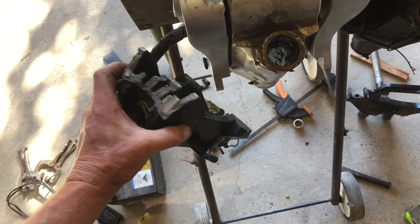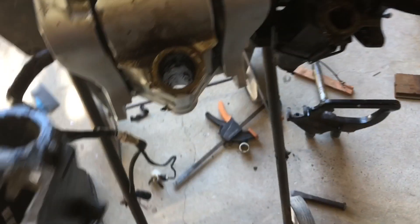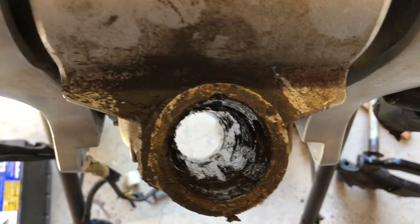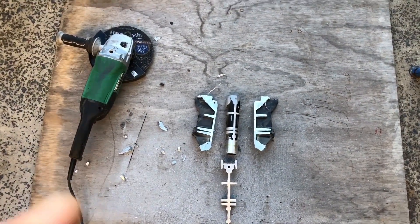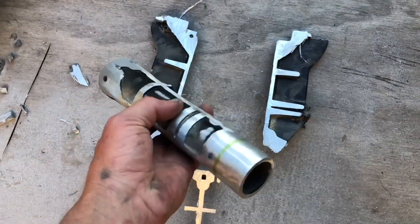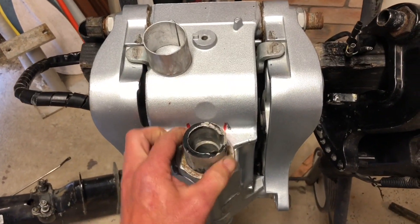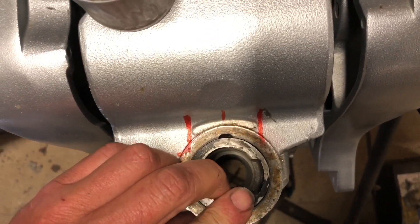I've removed the broken swivel bracket pivot tube from the 25-30 Tohatsu. I'm going to do what I did last time - cut all the ribs and stuff off this, leaving just the tube, and then hopefully make it fit inside this one and weld the top and weld the bottom. I've cut the sides off, just giving it a rough shape. This pivot tube will, once I've finished machining it, slide down in there through here and push into the top. It fits really, really well.